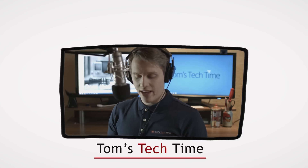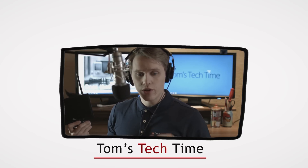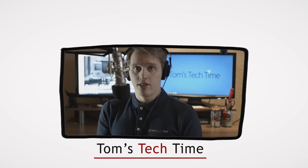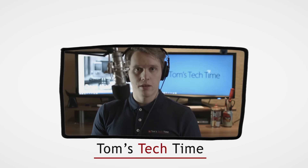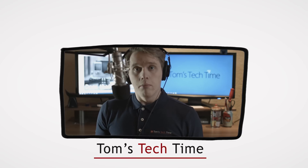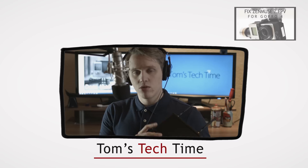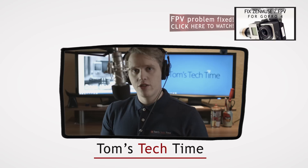The second problem was that we had no FPV connection at all. I'll show you how the monitor looked when it was perfectly installed waiting for a signal. The signal was there, but there was just a black screen. That's actually because GoPro changed the pins at the back of the camera, so now the pins are different from the Zenmuse's pins. But we can change that — there is a fix.